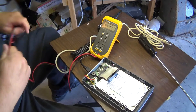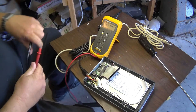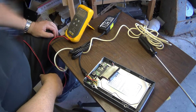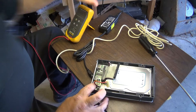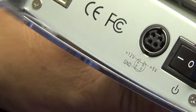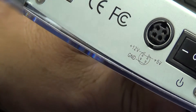Just a quick video to show what can happen when you buy stuff off the internet — you never know what you're gonna get. My neighbor had a problem with his power supply for his external hard drive. He got the plug in backwards, shorted it out, and blew his power supply. I showed him what he needed: a power supply with the configuration 12 volts, 5 volts, ground.